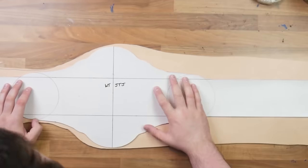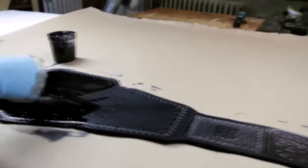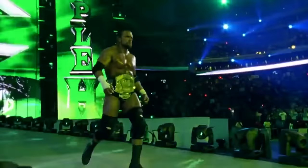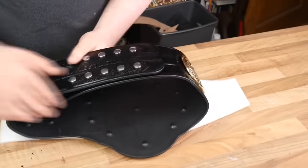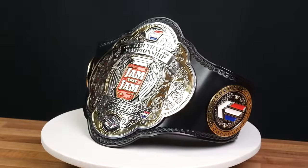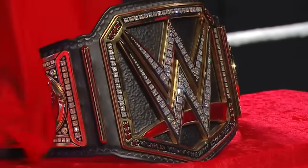Compared to making the plates, this process is pretty simple. The artist first traces the shape of the belt onto a piece of high-quality leather before using special tools to hand-cut the shape from it. This is then dyed the desired color before being waxed and polished to complete the outer surface. Workers then move on to the inner lining made from spandex or felt to make the belt comfortable to wear on bare skin. These layers are stitched together along with any other leather details before the plates are attached using either thick leather working string or industrial glue. The worker then adds the closing mechanism — whether buckles or hooks — and uses high-grade vinyl to complete the outer edge. Finally, the inside of the belt is branded with the agency and belt maker's insignia before being packed in a custom box and shipped off to the halls of wrestling history.